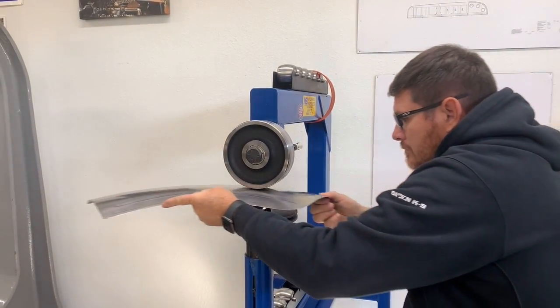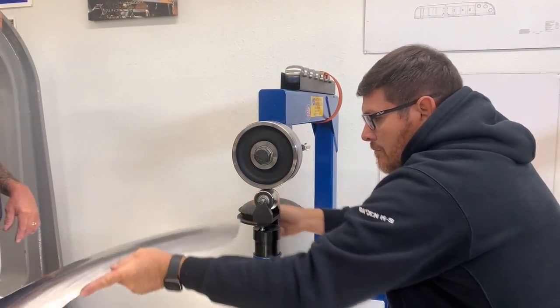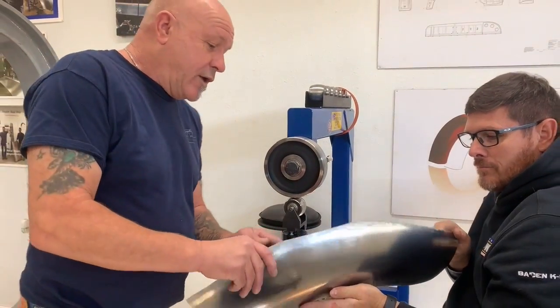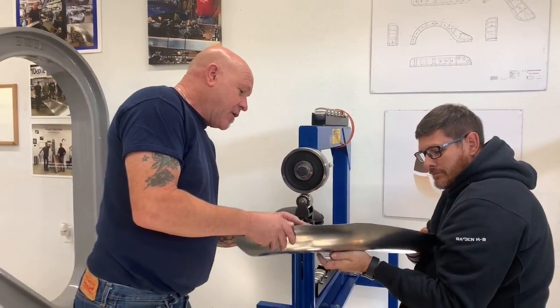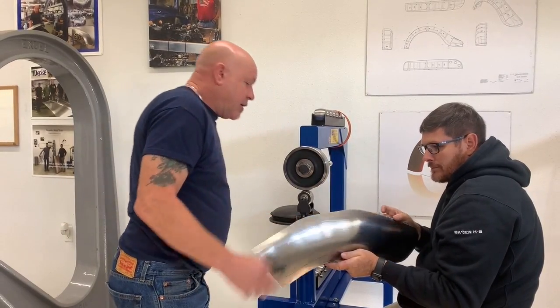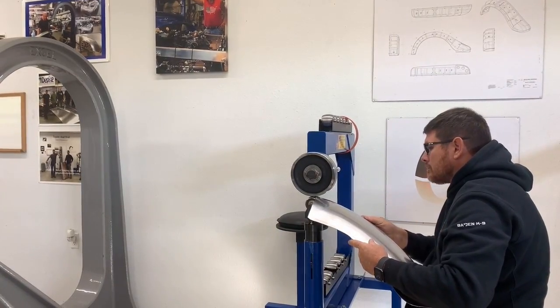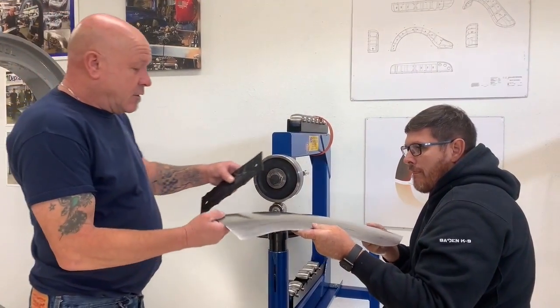And it looks like you're doing really nicely with the blow marks. So what I'm going to do, because like I said, I only put the pressure so that you're wheeling shape in it, but not very much, I'm going to do a tiny more pressure for you. You're good to go. So now we're just ready to start wheeling that shape in until you get it to conform to what we need.